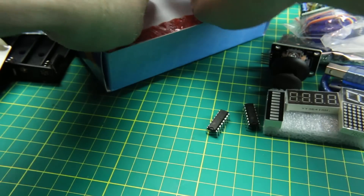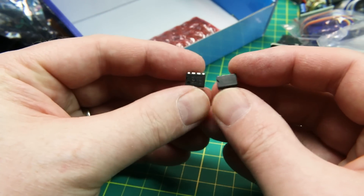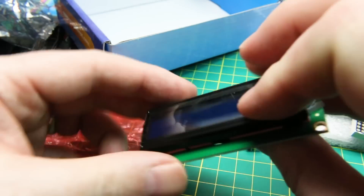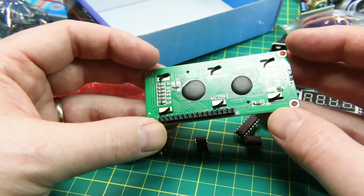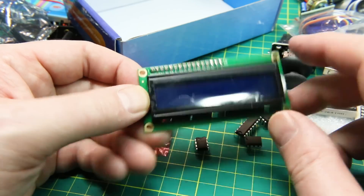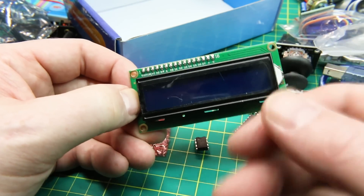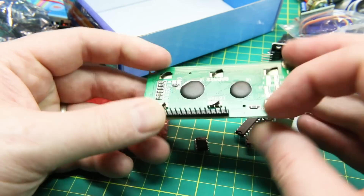There are various ICs — one is a 555 timer and I'm not sure what the other one is. We also got what I'm assuming is an LCD display — a nice little LCD display, looks like SPI communication, great to learn on. I would go ahead and eventually buy a Nokia 5110 or an I2C OLED once you use this one, but these work well for projects when you need a longer, skinnier display.